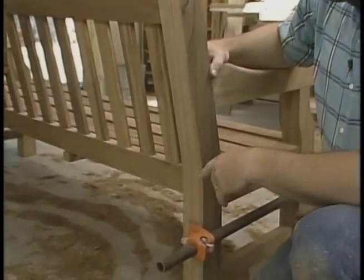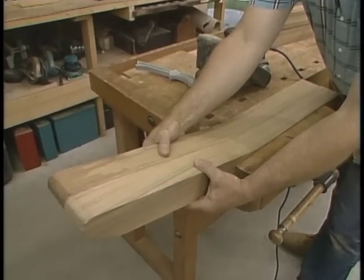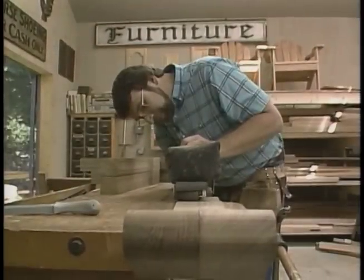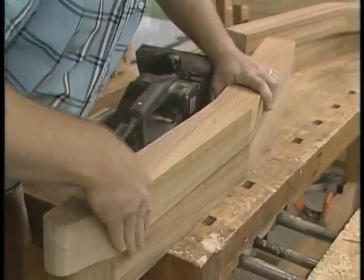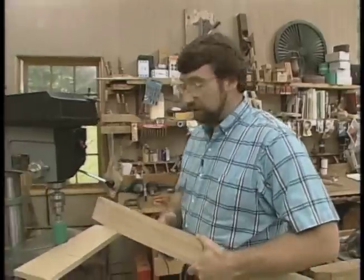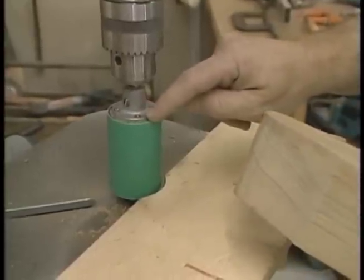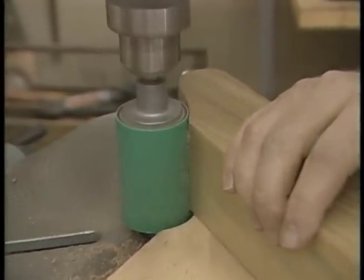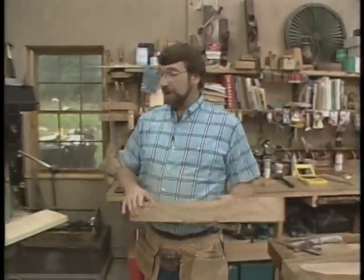Despite the fact that there are no intersecting joints on the back of this member, I still have to sand it smooth. I can't use the jointer, but I can use my belt sander. I've clamped both of the members in the vise and I'll just sand them together nice and smooth. Both of those surfaces line up pretty well. And now to finish off any areas that I couldn't do on the jointer or the belt sander — like these tight curves — I'm going to use my drill press, which is outfitted with a little drum sander with 100-grit paper on it. That does a great job, and I'll use the drum sander for the rest of the parts as well.